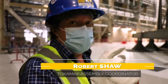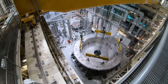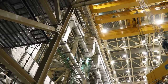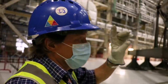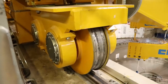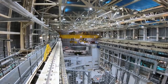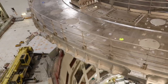The base will lift off at about 300 tonnes of hoist. We'll go in much smaller increments until we get to that point and then the base will move free. We'll then rebalance the load and lift it to about 100 millimetres. At that point we'll engage the load balancing system, synchronise the hoist in tandem mode, then lift and traverse. We have to observe the movement of the crane as it moves along the building to ensure that it's moving correctly and true. We have to watch the cranes as they traverse the seismic gap between the two buildings, and check until it's over the pit — then we've got very tight clearances all the way down, stopping to check that we're not going to pick up on any of the sharp edges in the pit.